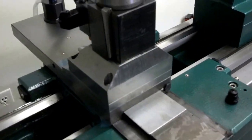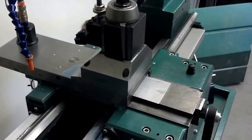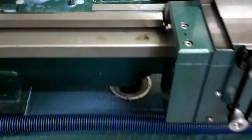Remove the compound slide, traded that up for a solid tool post mount, which I think was a good improvement. There's a lot of play in that compound, so it makes a nice rigid tool post. We've got the ball screws covered.